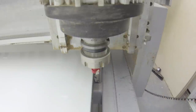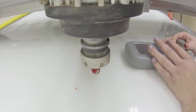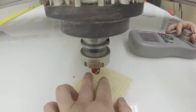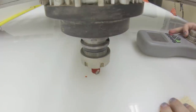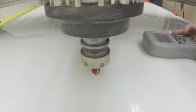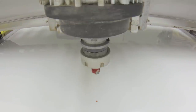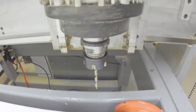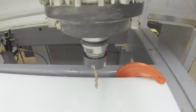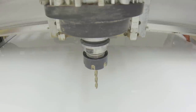We had the brilliant idea to do all these holes on a sheet router because we've got our big, beautiful sheet router. The problem is we didn't have the perfect setup. In drilling them, the chips would climb up the drill bit, which puts an unbalanced weight on a high RPM drill bit. The setup could have been better, because if you leave the swarf on the drill bit, it puts the bit out of balance, making it wander to the side. That makes the hole bigger than it should be and not necessarily round anymore.